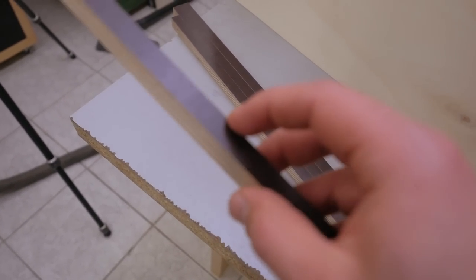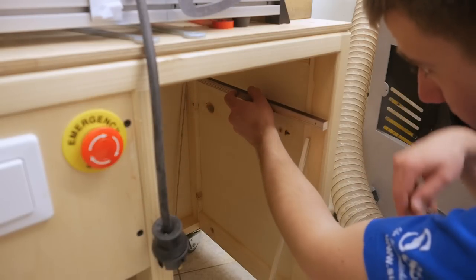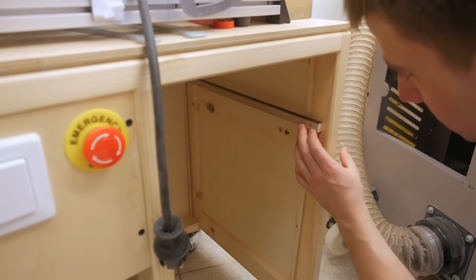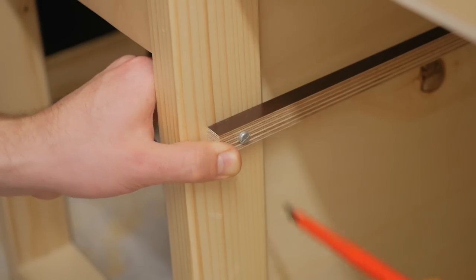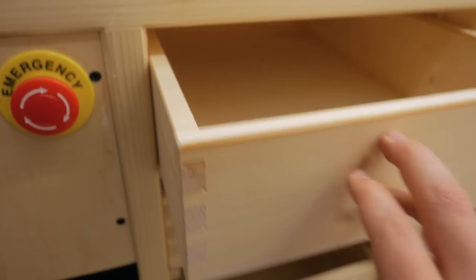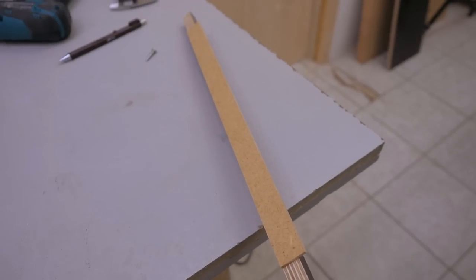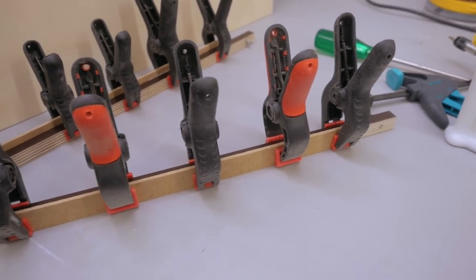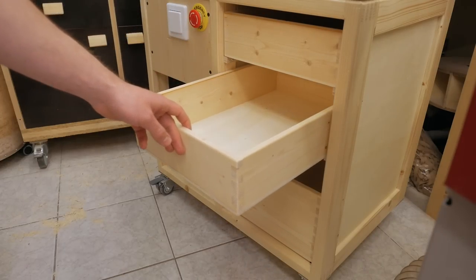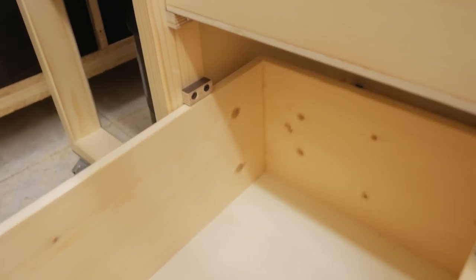For the drawer runners, I cut up some strips of plywood that have a black laminate on top — drawers slide really easily on that, and I've had good experience with it in the past. To mount the runners at the correct position, I cut two other pieces to equal length, and the runner can sit on that so I can screw it down. The top drawer slides nice and straight, but the middle one has a little slack and tends to get caught in the back. To prevent that, I glued on a strip of MDF to the sides to guide the drawer straight. These drawers also tip down quite a bit once opened more than halfway, so I installed little blocks that also give them almost full extension.